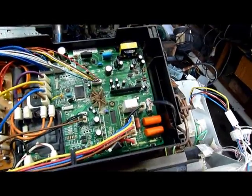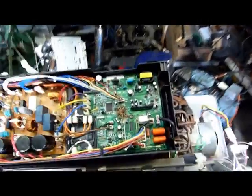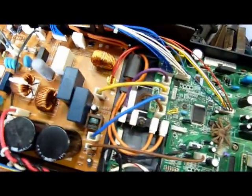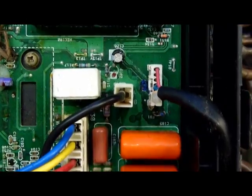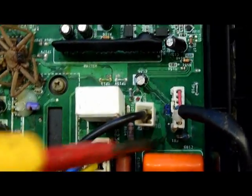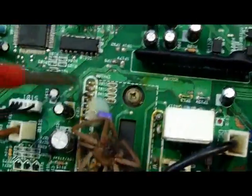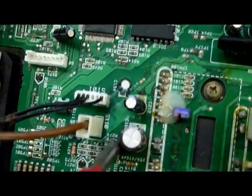According to one of the AC techs I was talking to on Saturday, he's replaced quite a lot of these and quite a lot of Fujitsu inverters for the same reason — critters getting in and shorting things out, or corrosion. There is corrosion all the way up to here; you can see traces getting eaten off. As you can see around that connector, those traces are fairly well broken down — it's stripping the varnish off them. There's oxide all over this board, lots of it.